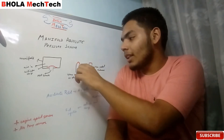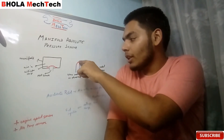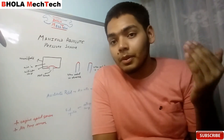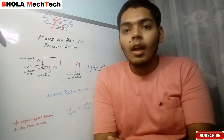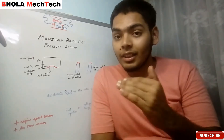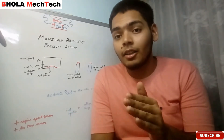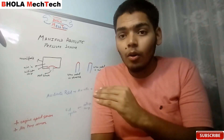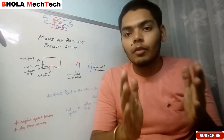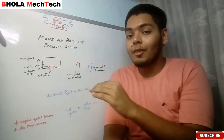Because the end points are fixed and due to suction there is some deformation, you can see the length of the silicon chip has increased. As the length increases, the cross-section must be decreasing. Due to this change in length and cross-section area, the resistance of the silicon chip increases. If we pass current through this silicon chip, we can notice the change in current. When resistance is less, the current will be more; when resistance is more, the current will be less.